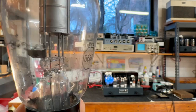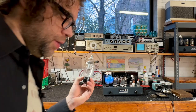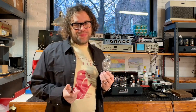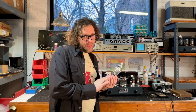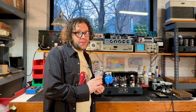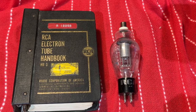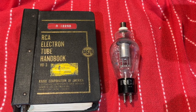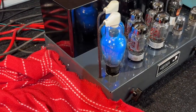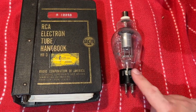In 1933, General Electric came out with the 866 mercury vapor rectifier tube. This is one of my favorite tubes — I love how it sounds sonically and how it looks visually. The filament of the 866 is 2.5 volts and draws five amps. Being that this tube is just a single diode, you're going to need two of them if you want full wave rectification. That small diode I just tossed can't handle 5,000 volts, but this 866 certainly can.